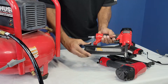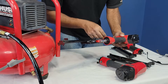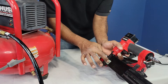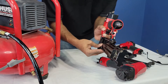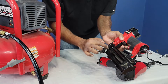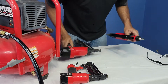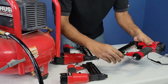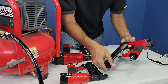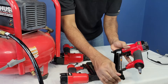On this particular gun, you open this lever and put the nails in here. It slides right in here. This one goes up to one inch, so you can put all the way to one inch of nails in here as well. And you pop it in. It gets nice and snug in there and it's locked in. This is another 18-gauge one. This one has a mechanism right here to open it up. It slides out. You put your nails in here like this, and it locks in.